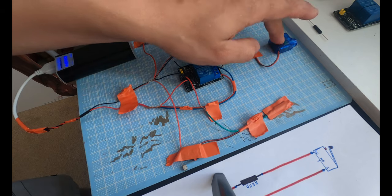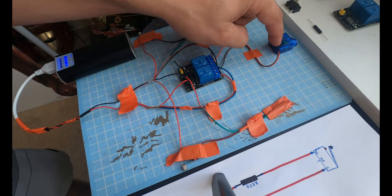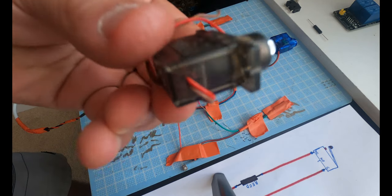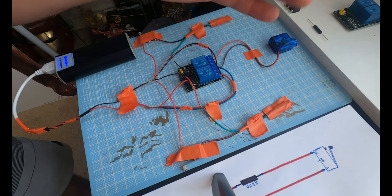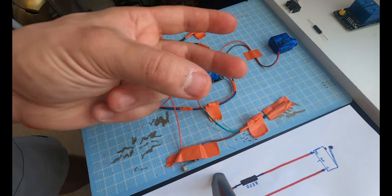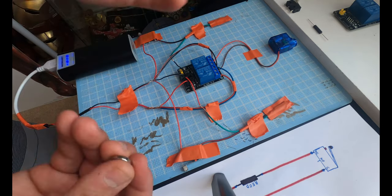Since we're using my hot-wired servo, and this is a plastic SG90 servo, it's a soft gear, I don't recommend these. Get the MG90s. These are metal gear servos. They're stronger and they won't strip out as easily. You'll hear this motor, it's already broken, but I left it for this so you guys can actually hear it. And what's gonna happen is in my fingers, I'm gonna have two controls, an open and a close. And there's gonna be a magnet on my thumb to actually control this.